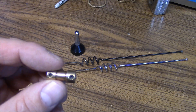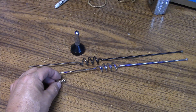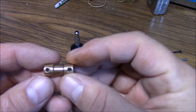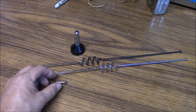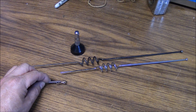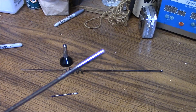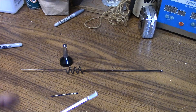You can get these DC motor couplers at hobby shops, and sometimes your more well-equipped hardware stores will have them. What we're doing is just hooking these two pieces together. These do use set screws to retain it, and in order to make it grip better, we'll go ahead and file flats into both sides of these rods, to the depth of halfway into the coupler itself. We just want to make this as strong a mechanical coupling as possible — a flat on this one and on the other extension rod.